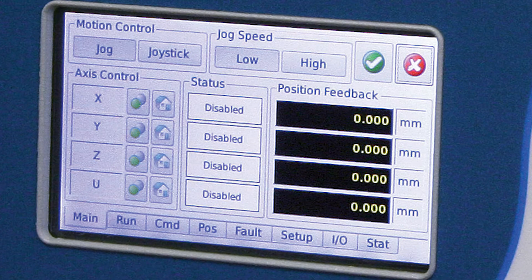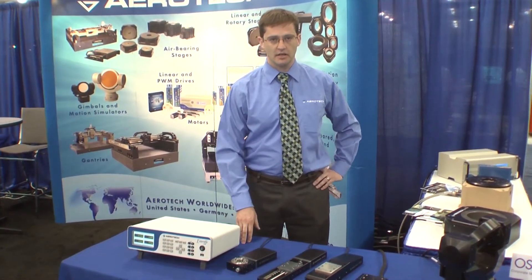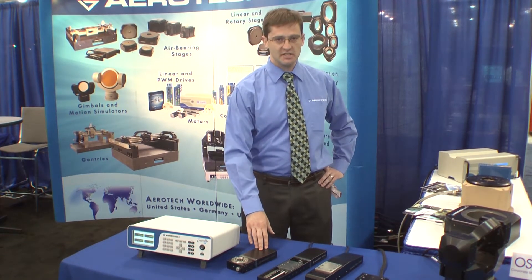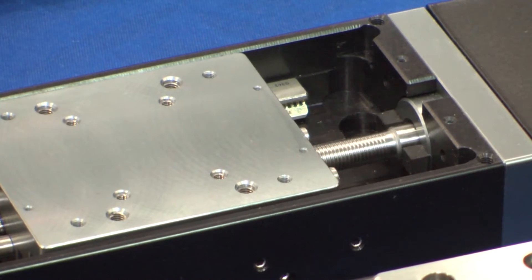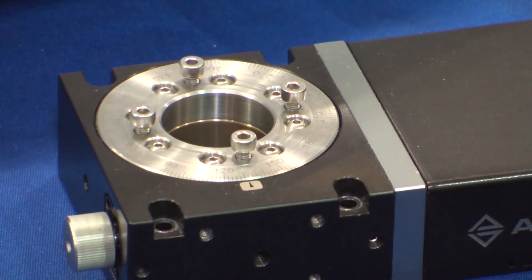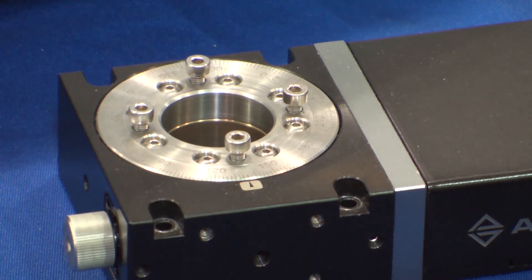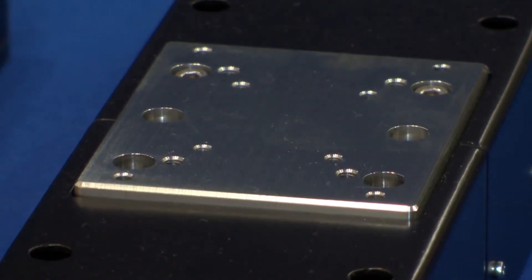Running on the Ensemble right now we have four members of the MPS stage family. These are micro positioning stages. The family consists of linear, rotary, and lift stages. They all have micron-level precision, driven by DC brush motors or stepper motors. They can be stacked and configured in almost any combination for multi-axis applications.